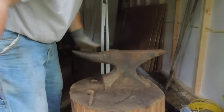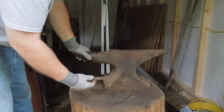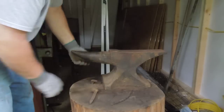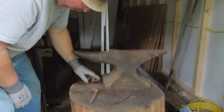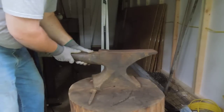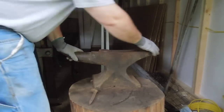The way I installed the anvil on top of the log was to forge down a railroad spike like this one into a narrow pointed shape — the taper fits into the hole in the front of the anvil. It's a nice snug fit, tapered to wedge in there.